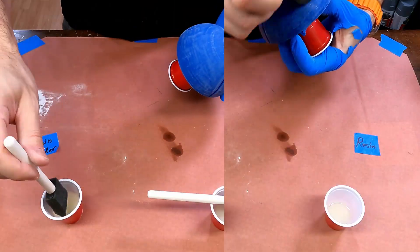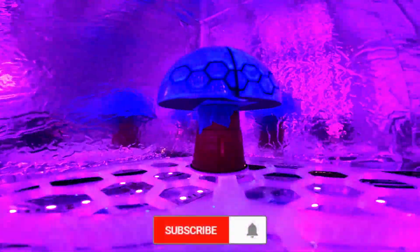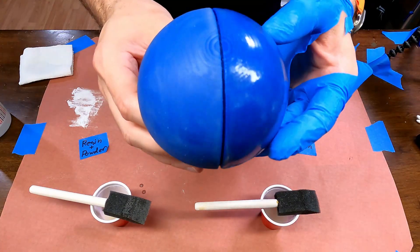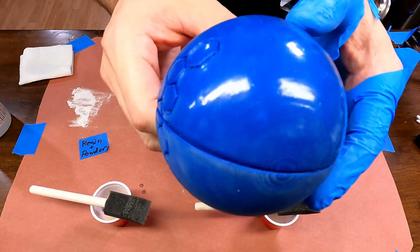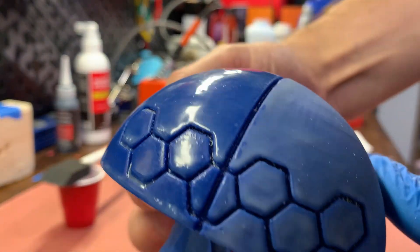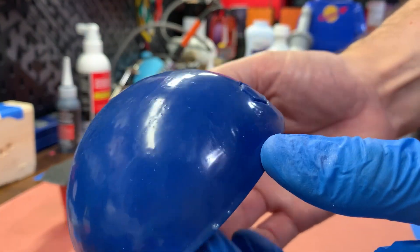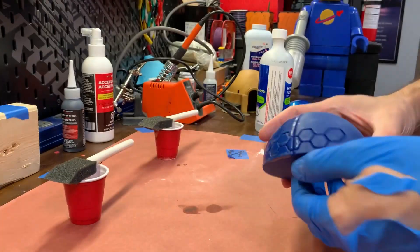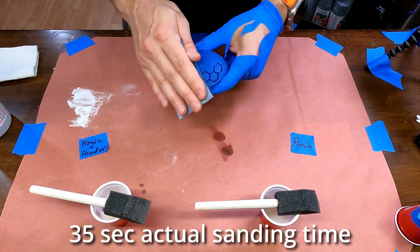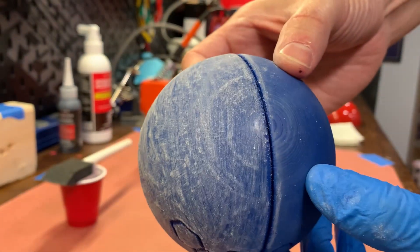Time for a second coat of resin on both sides. With a second coat applied, they look to have their layer lines fully filled in, except right at the top. The resin and powder side looks and feels smooth, whereas the resin only side is still smooth but there are visible waves in the resin. After another light sanding of the resin side, there doesn't seem to be any dust collecting in layer lines, so they are most likely all filled in — but there are still distinct high and low spots in the resin.